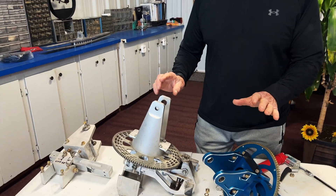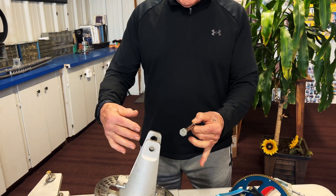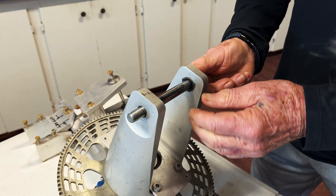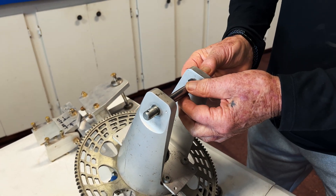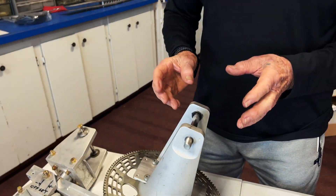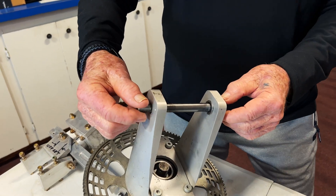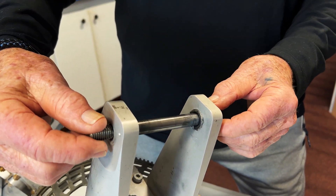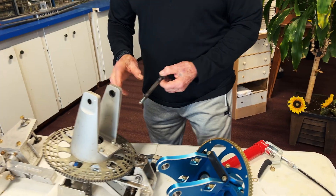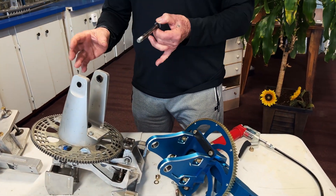It's basic. As far as where the rotor blades fit, you've got a teeter bolt. The teeter bolt rides on a couple of bushings. Some manufacturers use bearings, but in reality bushings are good because this teeter bolt teeters just minutely, so it doesn't really wear much on the bushings. Some of these bushings, manufacturers require lubrication, and we'll get into that a little later.